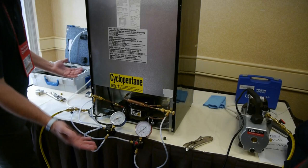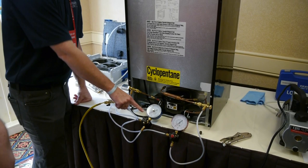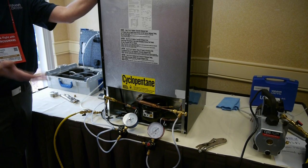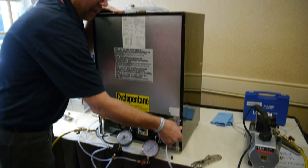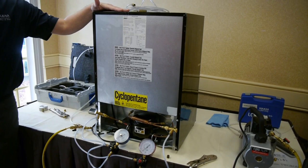I'm going to open my vacuum back up and slowly re-engage. You may see a little jump on the system — very slight. And it's right back to the vacuum that the compressor had delivered while it was discharging, which means I was right: I did get all the refrigerant out. Now we're pulling the evacuation. We've already done our repair, everything's being pulled down — you're evacuating all that air through the system. We'll go ahead and pull from both sides.